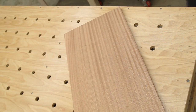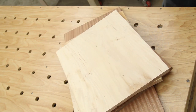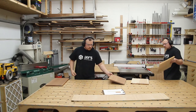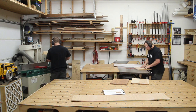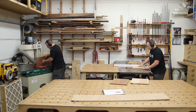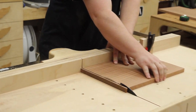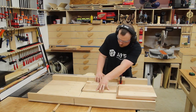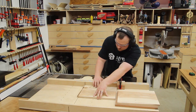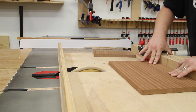At this stage the material was looking really good — the sapele was very clear and nice and straight grained, and the pecan was a nice contrasting white for the majority of it. Then it's back to the jointer to joint one of the short faces and put that freshly jointed face up against the table saw fence and cut all the pieces to their final width. I'm using the crosscut sled at my table saw to cut everything to their final length, because all of these pieces are shorter than the minimum capacity of my miter saw station stop block, so this gives me more repeatable results on smaller pieces.